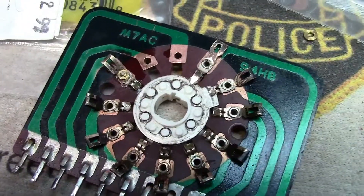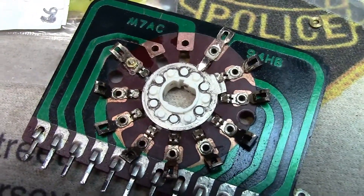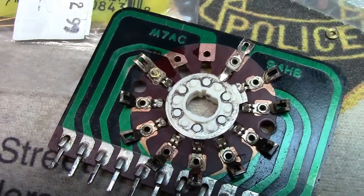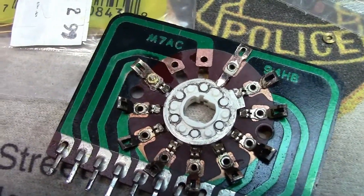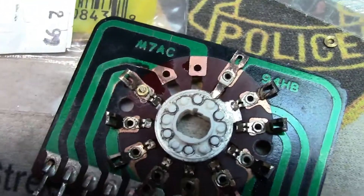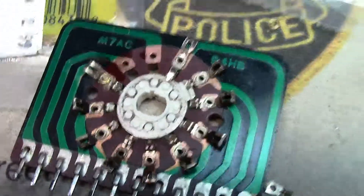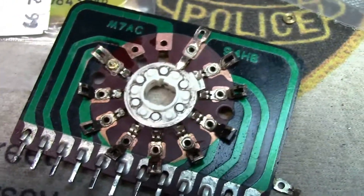Have fun with your TS-120 or 130. I've also fixed Heathkit DX-100 units this way when the contacts get burnt up or broken — same method, but for those bigger units you can use larger nuts and bolts, like size 1 or 2. For the small stuff, you need the double-zero, 00-90. Good luck, have fun — this is WA2BMB, Alex, out here in western central New Jersey. See you next time.